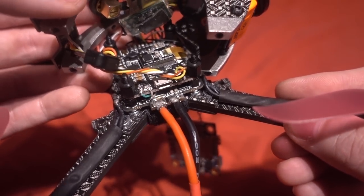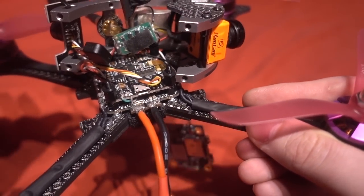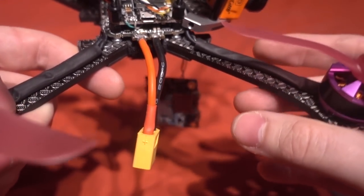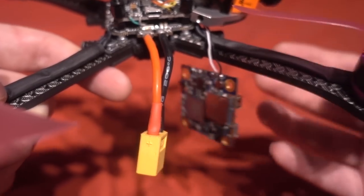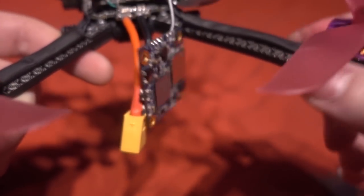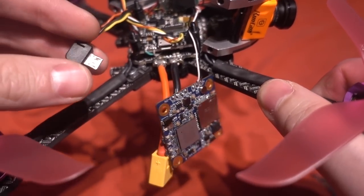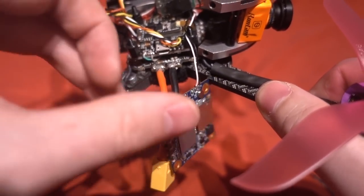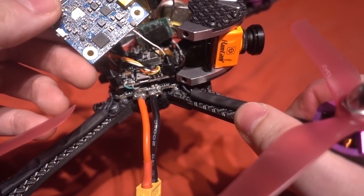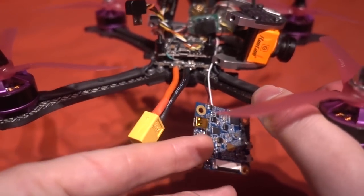Same with the V1. As I say, I think that's the biggest thing they need to work on. Very difficult though, because HD cameras and all of this produces so much RF noise and all sorts. So yeah, it's really tricky what they're trying to achieve here. So I think the results were pretty good considering. But that's how I have got it connected up, and not really benefiting from the wide voltage range. This has to be 5 volts through the USB still. It's only the solder pads that can have the wider voltage range. And yeah, so really not as beneficial.